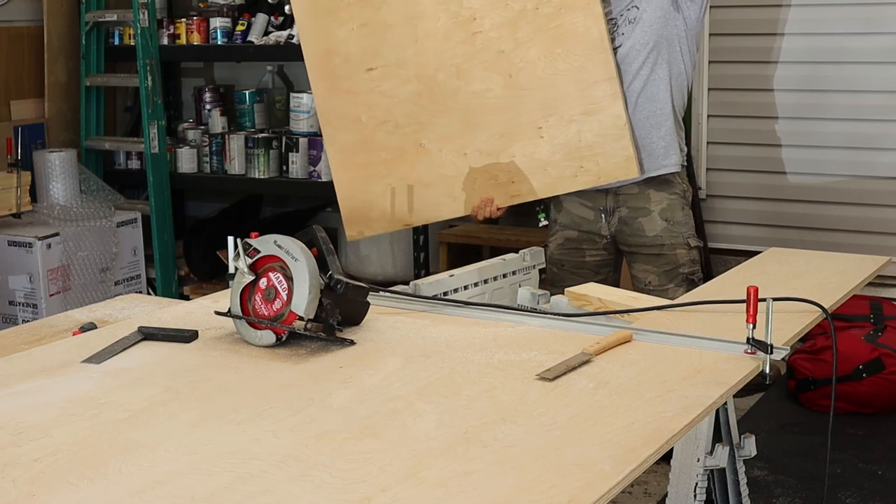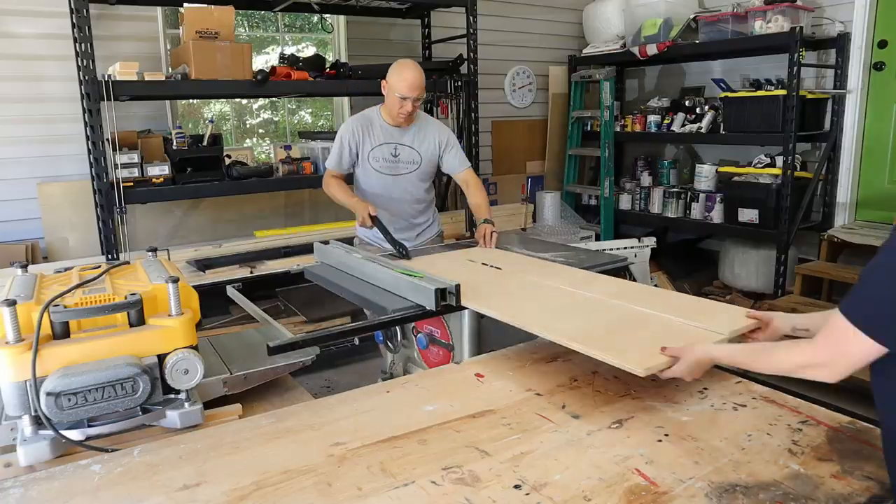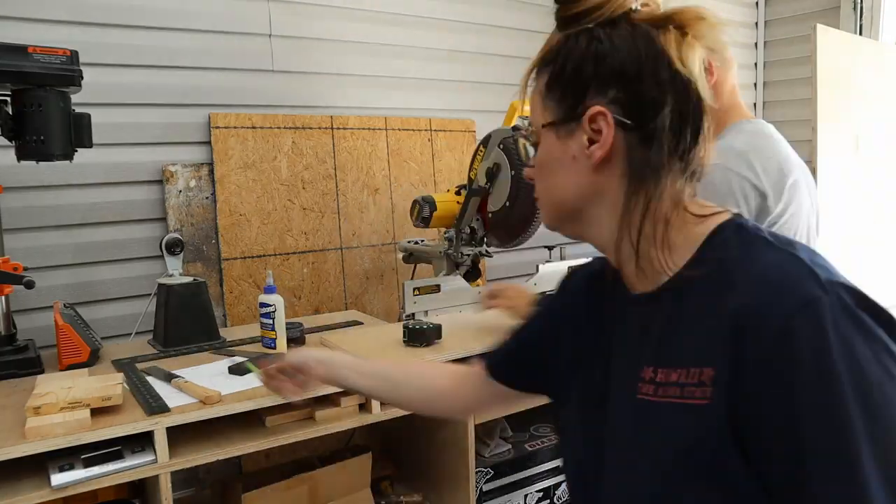So this is the headboard. Now we're gonna cut the footboard out — I want to make it 12 inches tall by 38 inches wide. I'm gonna use my table saw to rip it 12 inches, then my miter saw to cut it to length at 38. The footboard — the 12 by 38 inch piece — I cut off the drop from the first sheet of plywood.